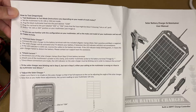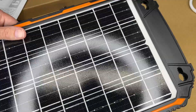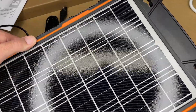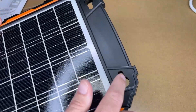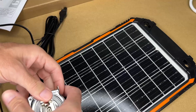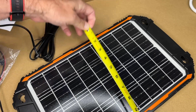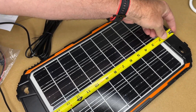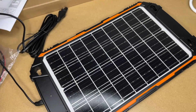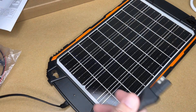Here are the technical specs, and the manual also explains how to test it. Looking at the panel itself, these appear to be monocrystalline cells — polycrystalline cells have a crystalline pattern on them. The top is tempered glass, with keyhole slots for suction cups, and the back is plastic. The solar cell width is right at 8 inches; the whole panel is about 9.5 inches wide. In the other direction the cell area is 13 inches and the whole panel is about 16.5 inches. The cord is around 10 feet, give or take a couple of inches.